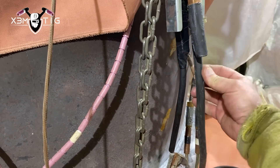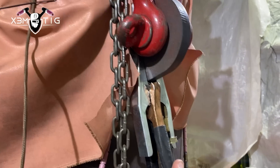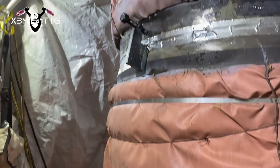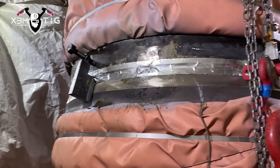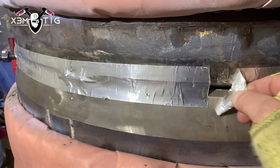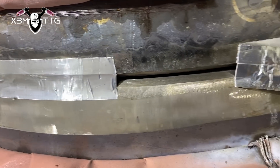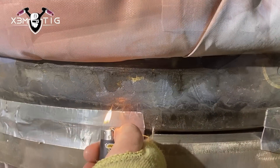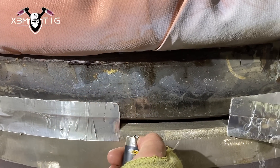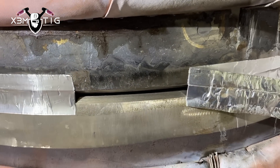This is one of Miller's best inventions — I really like it. We have that sensor ground that connects to the workpiece, or I just clamp it to the ground clamp, and it starts reading. You can set up the amperage right there close to you without running extra cable — it just connects to one of your leads. As for the fit-up, the day shift did it. It's about a loose 1/8 inch; I prefer a slightly bigger gap. 5/32 would be ideal, but it is what it is.